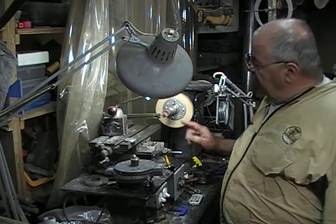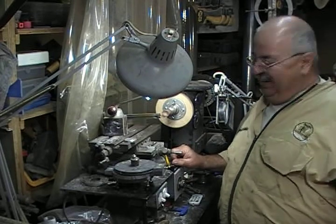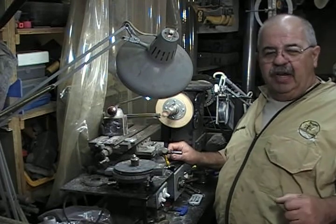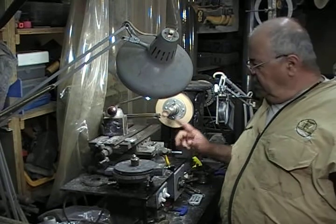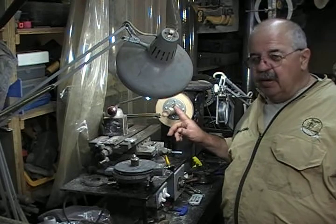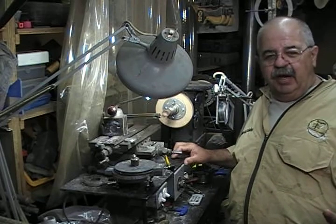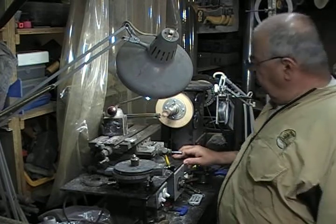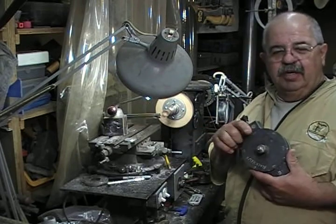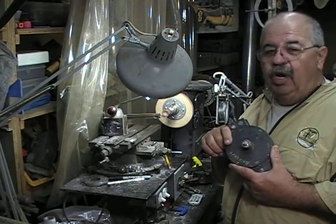Well, that proves to me that it will work. Also, this piece of black walnut can't be used for ornamental turning. But it will do the offsets. So I'll chuck up something with a little more cellular strength, like a piece of ebony or African blackwood, and go ahead and spin a couple of finials. You've seen how this one is and how simple it is to make. Remember the caution about spinning on a regular lathe — let's just not do it right now. I'll work on something else for you along those lines. It's a simple rig. Free plans are coming up, but first a word from my sponsor.